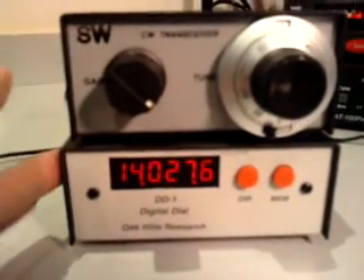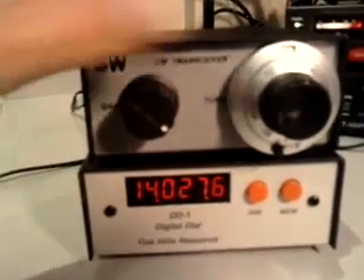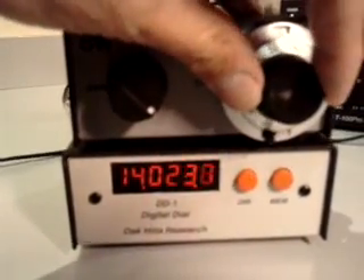If you do this in this way, you have to adjust very, very carefully the input sensitivity of the frequency counter for a stable reading of the frequency of the transceiver. 73. This is Juan EA5BLT.